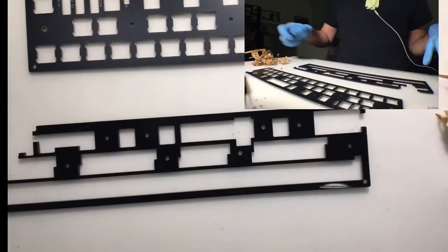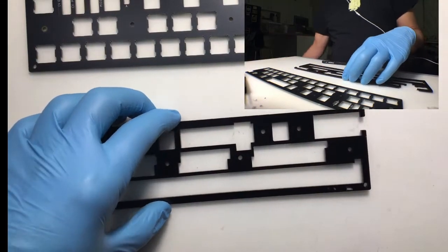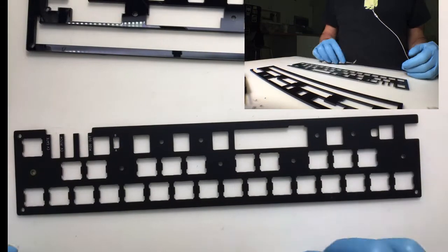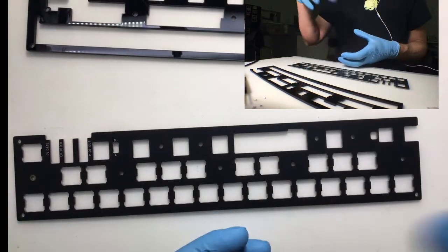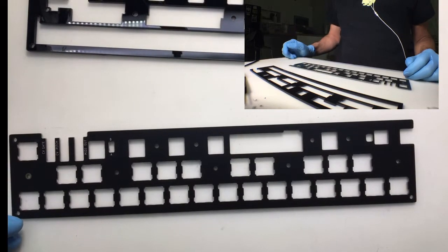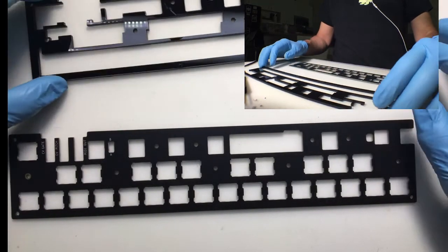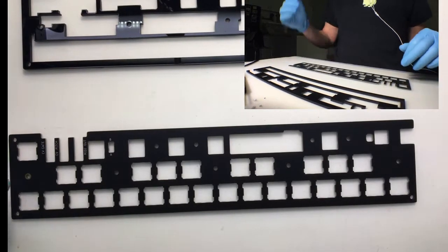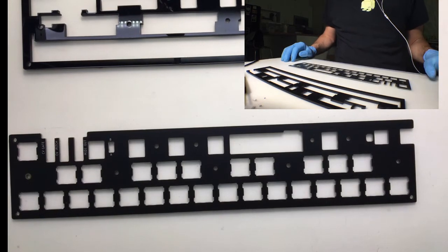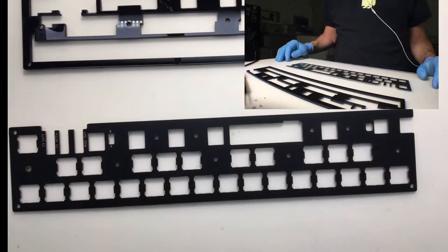All right, we have our spacer ready, and we're going to set that aside and swap it for the key plate, which is this PCB business, this guy. So this is sort of the top of the case, and the keys go into this, then attach to the PCB, which I will show you in a minute. If you soldered your keys on first before doing this, you're going to have to start over. Sorry, a couple people just jammed through and started soldering stuff, and I apologize for not having a video ready earlier, but read through the documentation, and this information is there, I think, and hopefully described well. If not, I'll try to make it better.